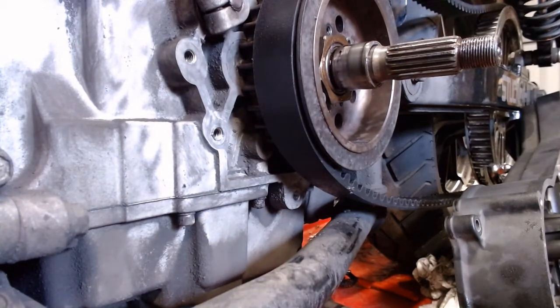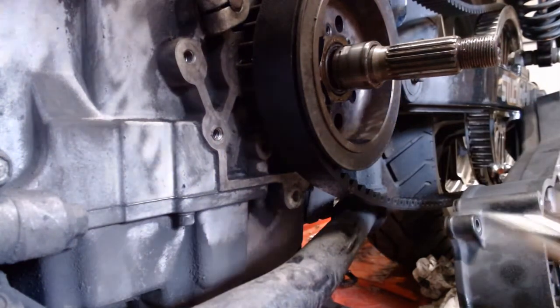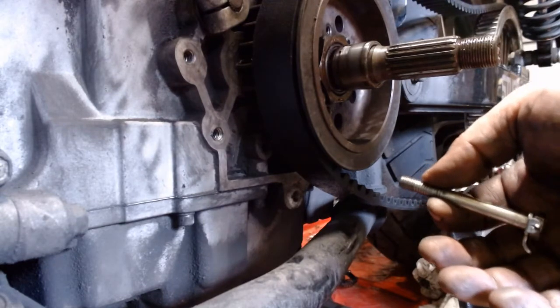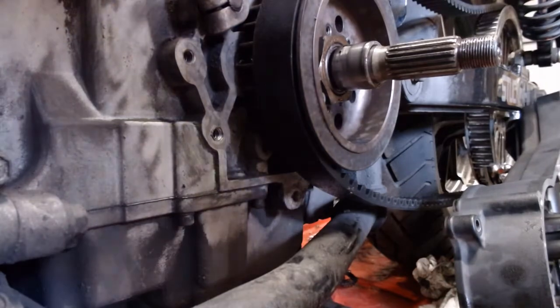There's still about a half inch of thread in there, so I could have the option of drilling in further and then running a bottom tap in there. I would have about a half inch of threads, but they say 125% of your bolt diameter is the minimum amount of thread engagement you need — and it would probably actually be a little under 125%.